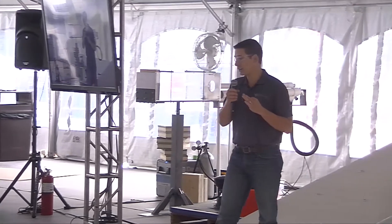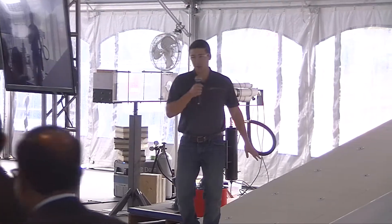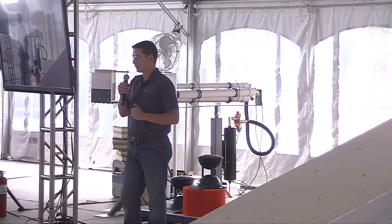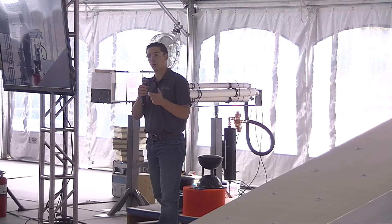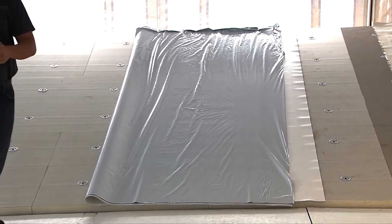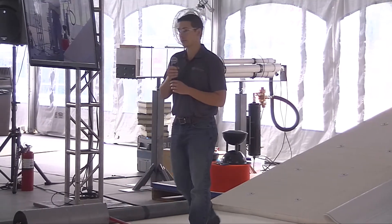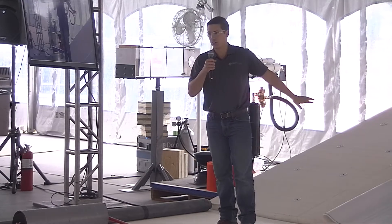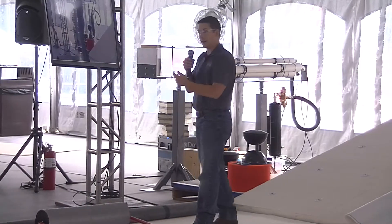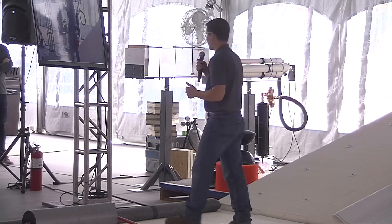Since last year, we've added a third product to our offering. What you're looking at right up here is our SecureShield RL — coated glass face on both sides, 20 psi poly ISO with RapidLock technology. So now we have three options: paper face, the coated glass face product, and high-density poly ISO — all can be substrates under the RapidLock roofing system. The top facer acts as the hook, and we've optimized the fleece on our fleece-back membranes to act as the loop. Hook and loop, no adhesives on this system.